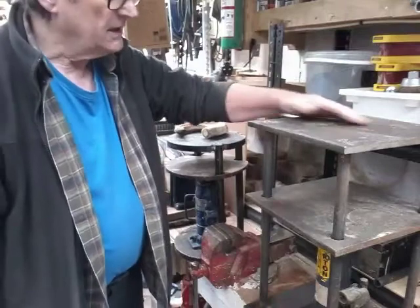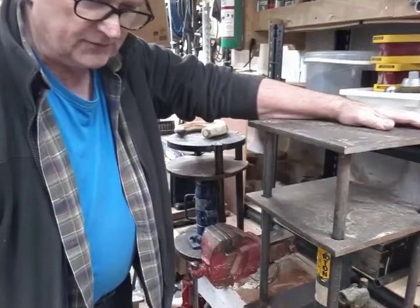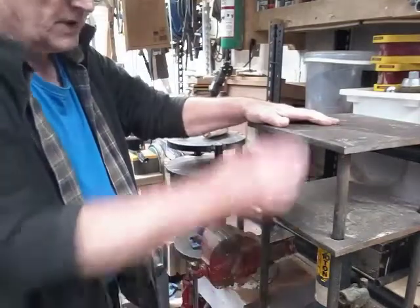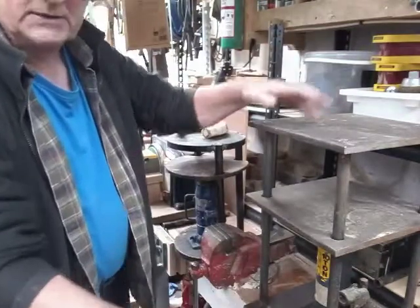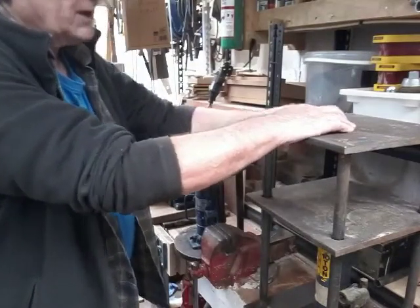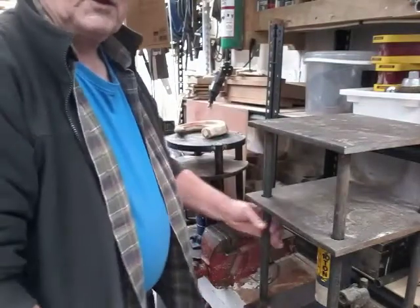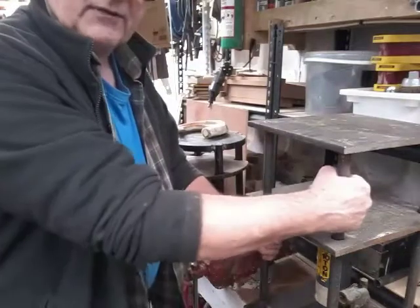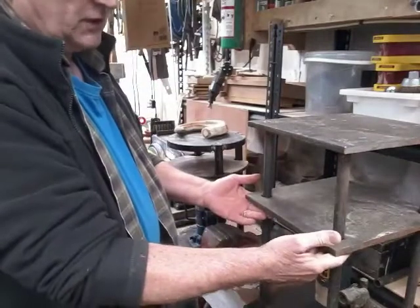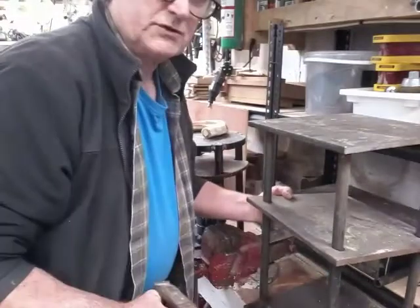If you can weld you can make one yourself, and if you can't weld you can still make one, because you can certainly buy a plate — sometimes with holes drilled in the corners. They use these for stanchions when they build buildings. You can get some heavy-duty threaded bar and use plenty of nuts and bolts, and you can create something like this and it will still work. As long as you've got two sets of nuts top and bottom and it's nice and strong, it should work. And if you're using threaded bar here instead of plain bar, you can also put nuts on there to work as stops for the middle plate so when you take your bottle jack out it doesn't drop down to the floor.